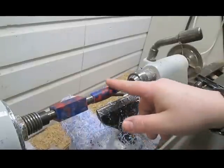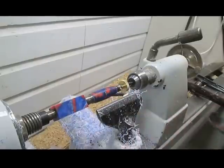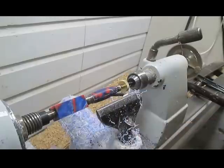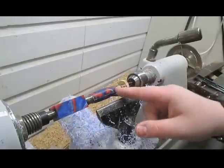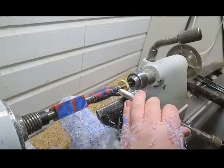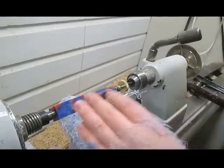That's actually pretty cool looking. I really like the pattern on this, and I'm actually getting a pretty smooth cut with my roughing gouge — that's pretty easy to come at this with, and I just sharpened it up too, so that helps. Next thing I'm going to do is use these bushings at each end of the pen blank to tell me the diameter I need to turn the edges down to, and I'll smooth this whole blank over to a shape I like.